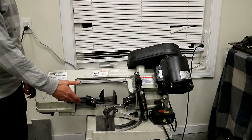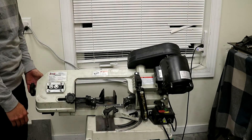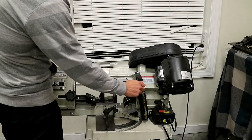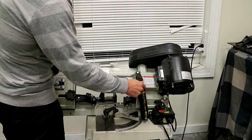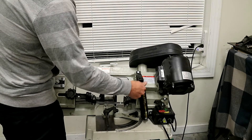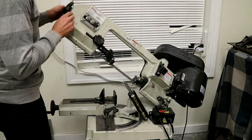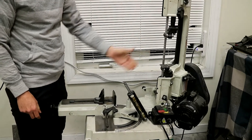Another great feature is that this saw is both a horizontal and vertical cutting saw. To switch to vertical cutting, I just leave this Allen bolt loose and unscrew it with my fingers. That disengages the hydraulic down feed. From that point all you have to do is lift the saw head up and now you are in the vertical cutting position.